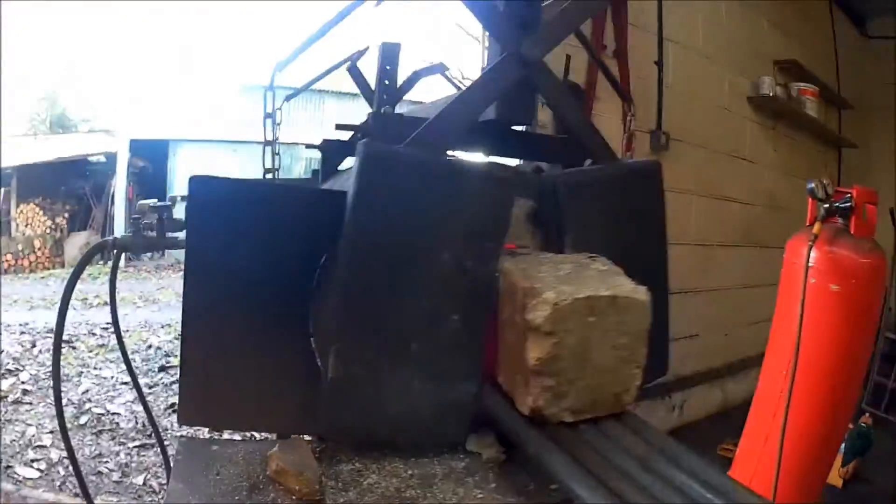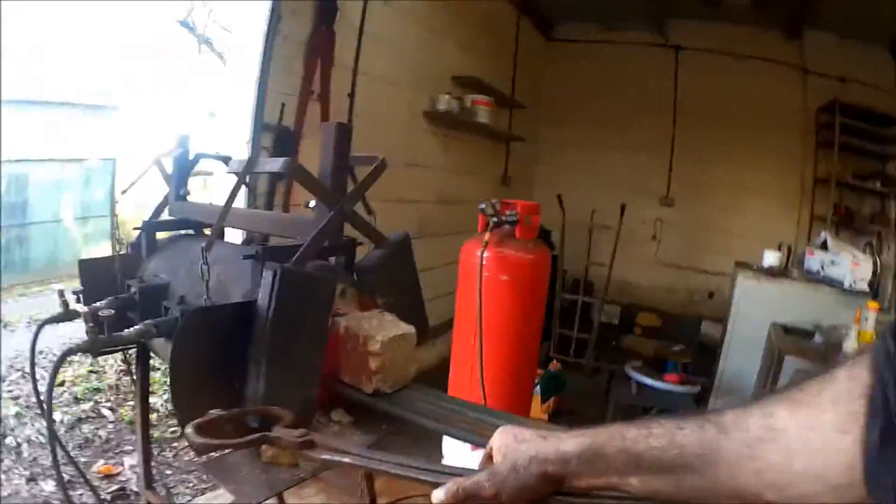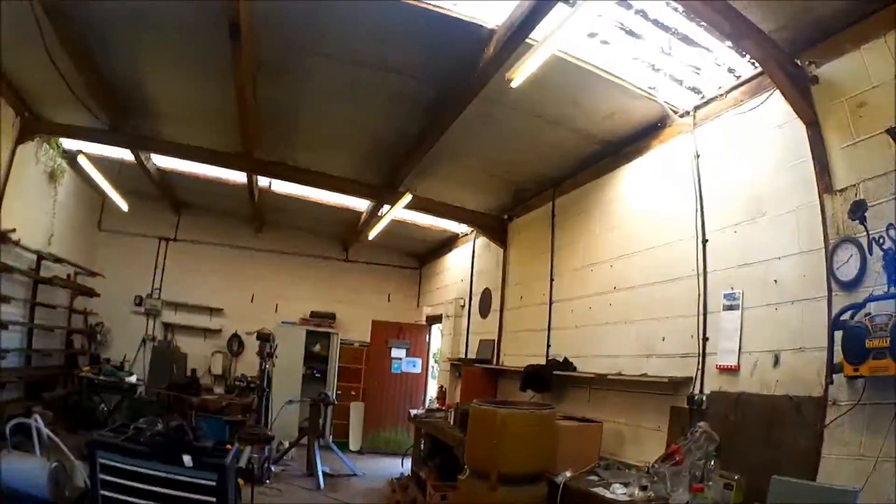It's so hot — you can see I'm really sweaty. Loads of heat comes off this gas forge when it's in full blow. Things to be careful of are obviously carbon dioxide and carbon monoxide build-up. That's the reason why I've got both a fan, the big door, and the back door open to try and create as much airflow as possible so I'm not poisoning myself. It's very dangerous — if you're not too sure, don't do it.